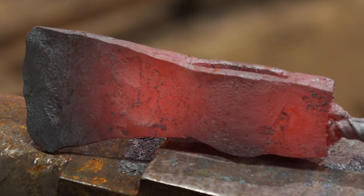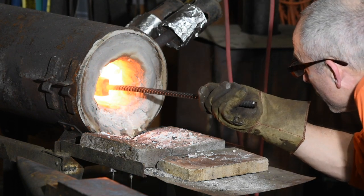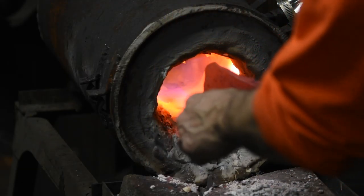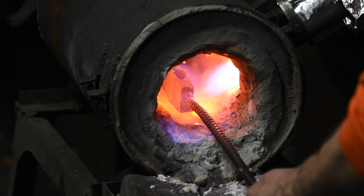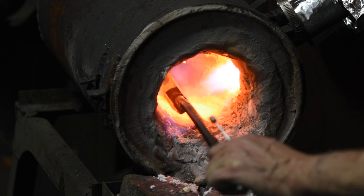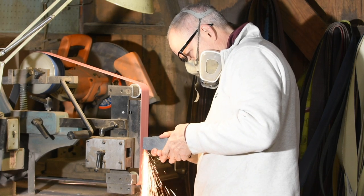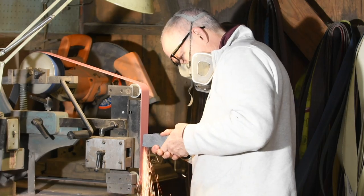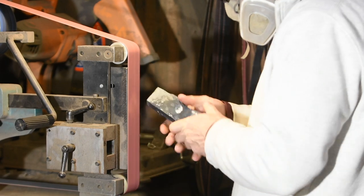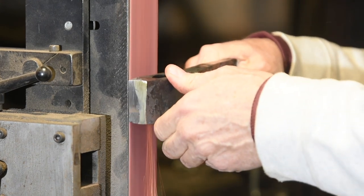I'll normalize the blade several times, heating it to around 1,600 degrees, then cooling it to refine the grain structure. Then I'll roughly anneal the blade, heating it to below critical temperature and then leaving it to cool in the forge. This should result in a ductile, close-grained blank, making it shock-resistant and unlikely to crack. Now I'll turn to the grinder and refine the shape a little. I could take off all the scale and make it look like it came from a factory, or I could leave all the scale on and have it potentially end up with some geometrical flaws that'll undermine performance. So I'll kind of split the difference, doing my best to maintain that hand-forged, rustic look while refining the symmetry and geometry to make it perform well.